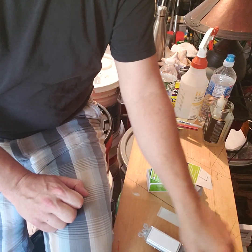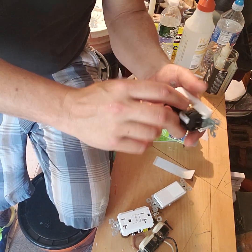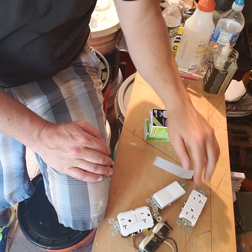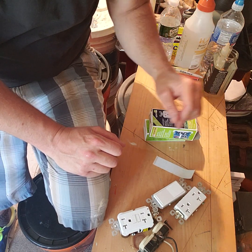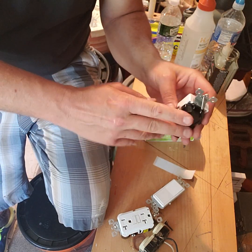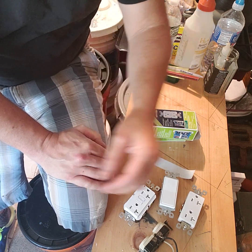There's a lot more advanced stuff but I want to keep it basic. For general 120-volt work, always tape your terminals when you're done and make sure everything is tight — you don't want any loose connections. Tape all your connections, make sure everything is grounded. You want a ground coming out of your receptacle and a ground coming out of your box — tie those in. Check out some of my other how-to tutorials. Thanks for watching.